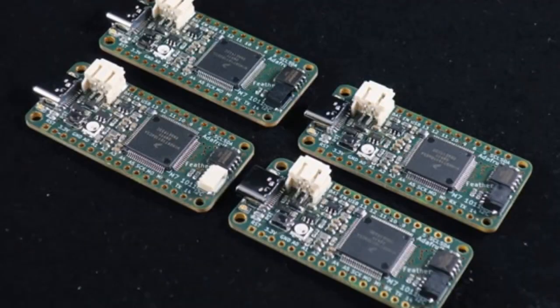Next up, you can check out all the new Feathers. This is the upcoming — super early, don't ask, it's not out yet — Feather M7 RT-1011, designed by Arturo182, who's been doing a lot with the NXP iMX chipset. It's a very inexpensive but very powerful chip — it runs at 500 megahertz. We thought, wouldn't it be cool to make this into a Feather? We already have a CircuitPython build and are working on having the UF2 bootloader as well. The goal is to get this roughly $1 chip onto a Feather to get it out into the world. It's a four-layer board with a USB-C connector — coming soon.